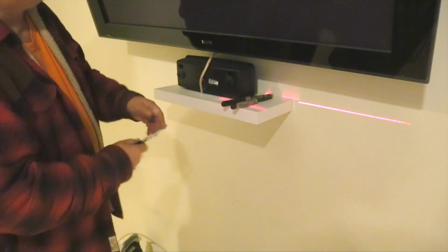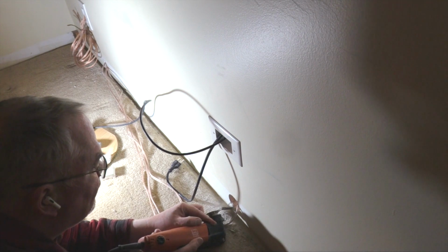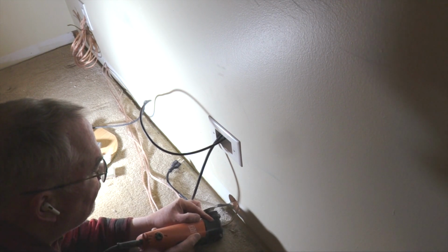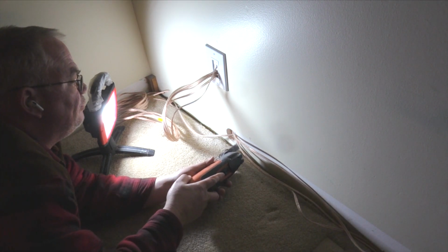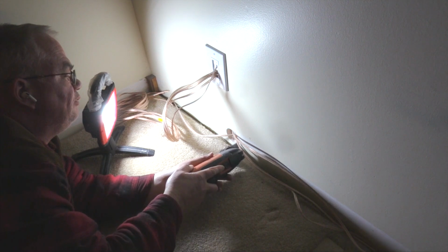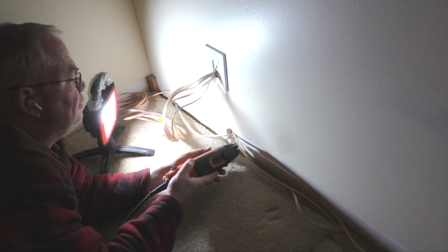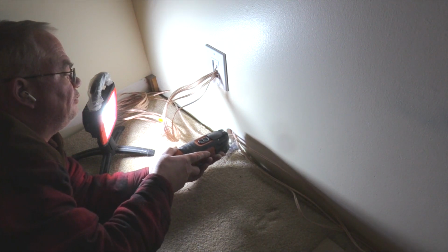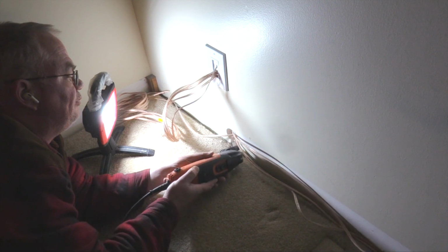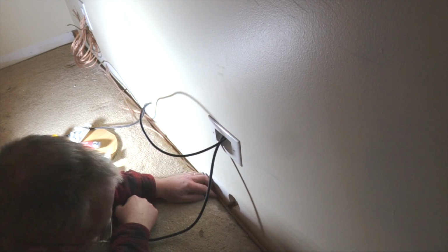With the shelf in place, it's time to strip back the wires and install the center channel. Next, I'm going to cut the passage for the center channel and the monitor wiring. I notched the lower edge of the drywall to transition the speaker wires from the channel along the floor to the hole and up into the wall. From there, they pass through the low voltage box and the brush cover. I'm using an oscillating saw, but a razor knife could also be used. The speaker wires are laid in the channel formed by the gap between the carpet and the wall.